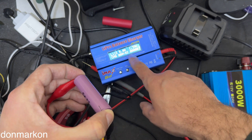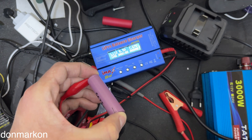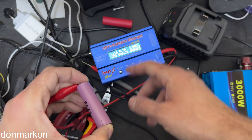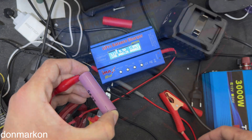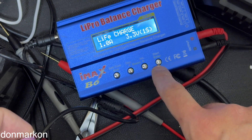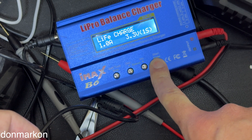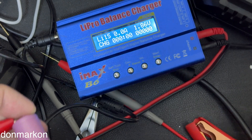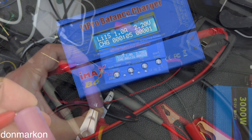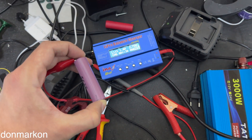You can see here that the battery voltage is jumping. From 1.3 it is already 1.6 — we want it around 2.7. At that point a regular charger will be able to recognize the battery. What I'm going to do now is raise the amperage to 1 amp. We have voltage jumping rapidly. Here we are at 2.7 volts — it was quite fast but we needed 1 amp.